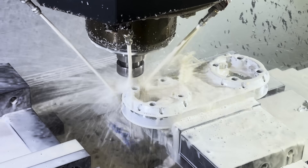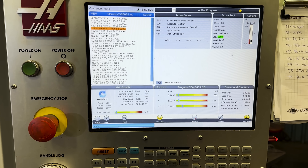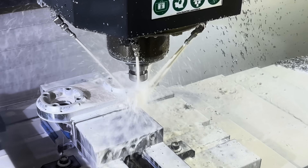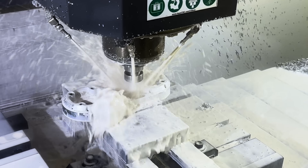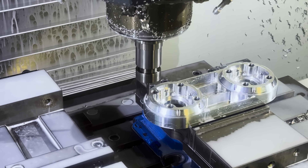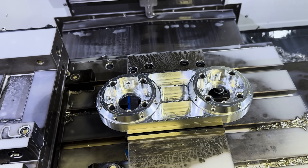We're going back to finish these bosses. I did cut quite a bit of this footage because it does take quite a while — it's a very fine finishing operation, and that's not a Cloud NC thing, that's a programming thing. This spits out normal G-code. We're running 100% feed, 100% rapid, just letting this thing go. We did add M00s between the ops because I was nervous, and I will tell you I probably didn't have to — it didn't do anything silly. Total runtime was about two hours for this part, and a lot of that was the finishing on those angles. If you need a really fine finish, it is going to do well. Now let's finish this part with our chamfer toolpath — a quarter-inch drill mill, 45 degree — going in to finish all our little cusps, detecting everything we need to do there.